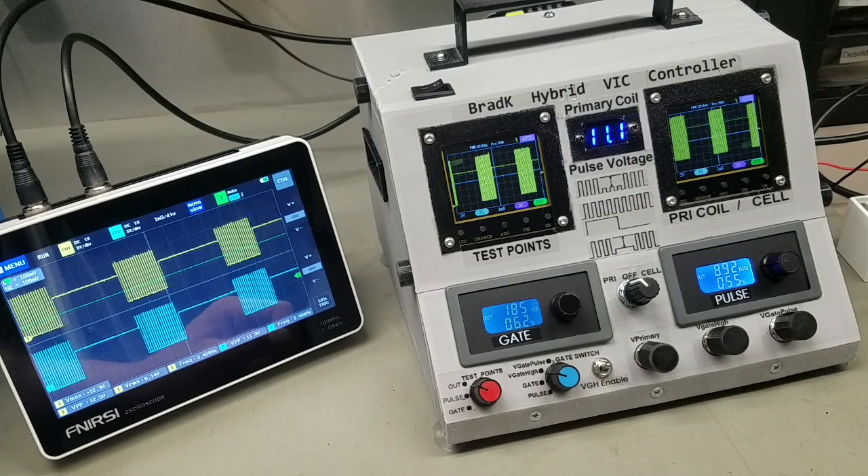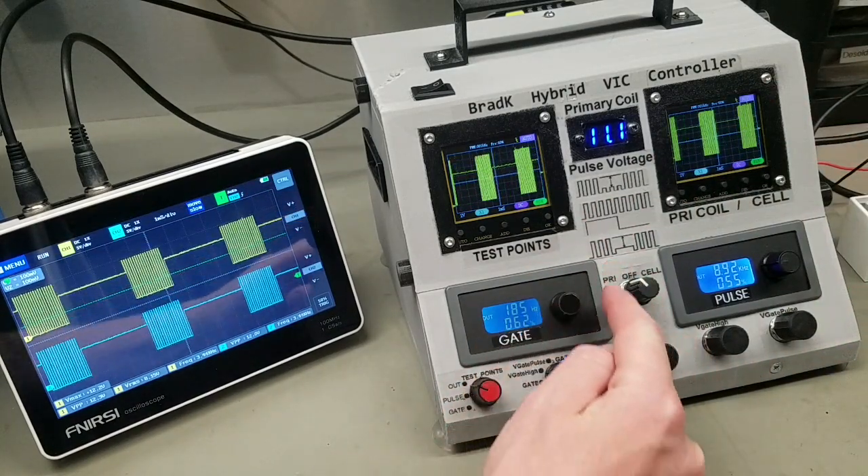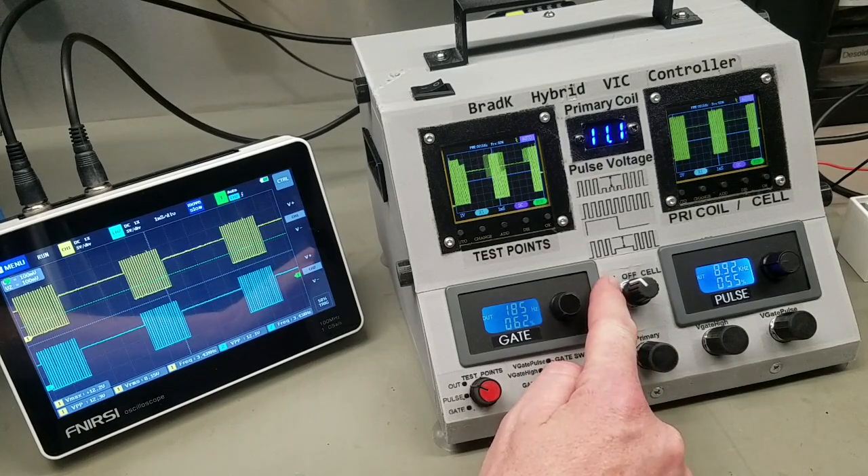In the middle of them there's an off switch — an off position on that circuit. There's an RC circuit that would drain off any voltage in case I get a high voltage to that switch; it'll drain it off before I reconnect to my hybrid VIC driver, to hopefully protect that circuit.